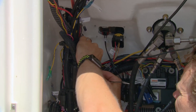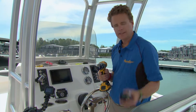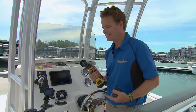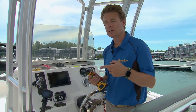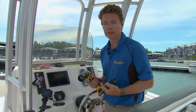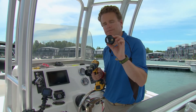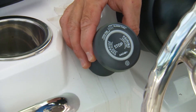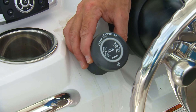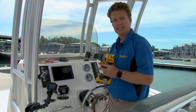Once you've got that together you basically just plug it back in and we're ready to start cutting holes. Felmarine recommends a 2 and 1/16 inch hole saw bit, which is 52 millimeters. If you can't find one, a 2 and 1/8 inch — which is much more common at 54 millimeters — should work; there's enough space on the hub to cover the hole. Before pressing a hole saw to the gel and glass, I like to tape the area off — in my experience this, along with a light touch, helps avoid chipping the gel.